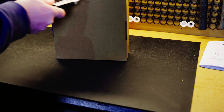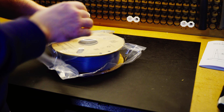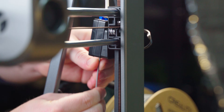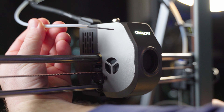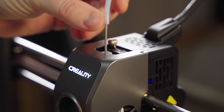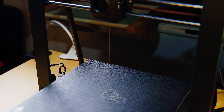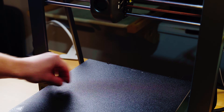While the diagnostics is running, we're going to open some filament that Creality provided to us. Running this through the filament sensor, waiting until it comes out the other end of the Bowden tube, and then we can stick that into the hotend and let it start to draw through. You should see it extruding from the bottom. Once it's finished extruding, you can clean up the mess that it leaves, and we're ready for printing.